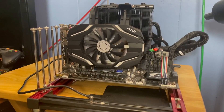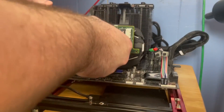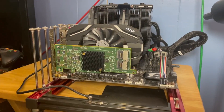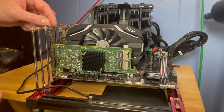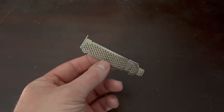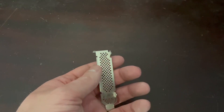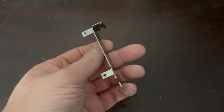Anyway, it's a PCI Express card that has two mini SAS ports on it that you can use to expand your storage capabilities. Installing this thing is nothing new if you've installed a PCI Express card before. You just plop it into an open slot on your motherboard and screw in the PCI bracket just like any other card. And thankfully, this thing also comes with a low-profile bracket in case you want to use it in a smaller or a rack mount chassis.